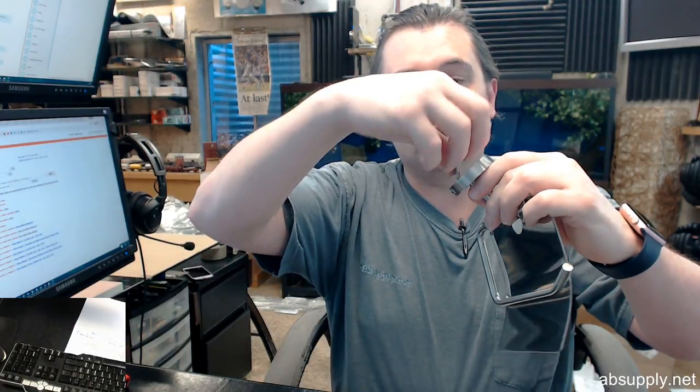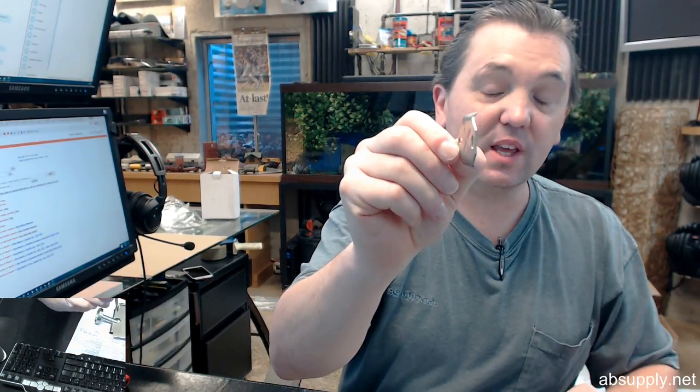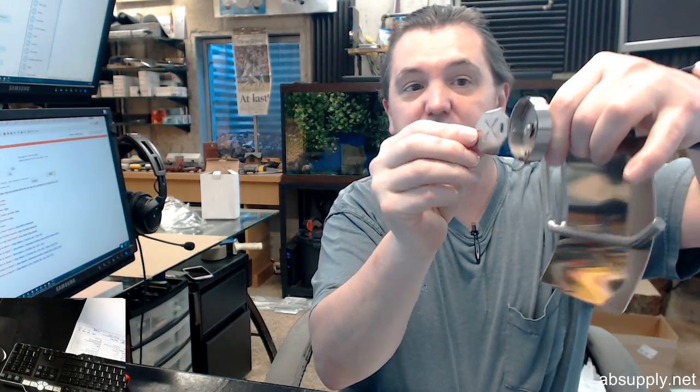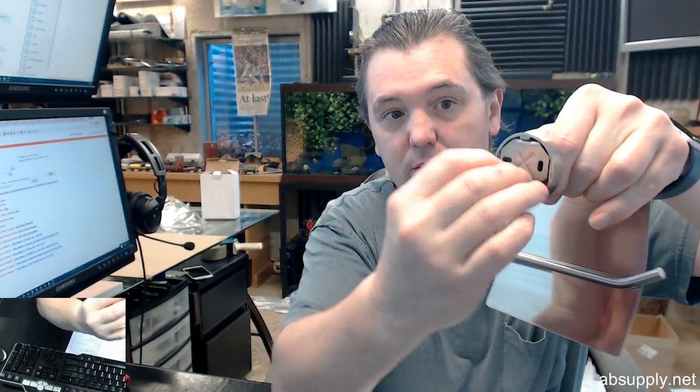There is a wall plate that's held through the set screw that you may have noticed down here, and I will quickly remove that. Once you get that set screw loosened, that wall plate will come out. You'll attach the wall plate to the wall with the flanges pointed towards the outside. A couple of screws are included with plastic anchors, and then the Allen wrench that you'll need to handle both aspects: reversing the bale should you need, and loosening the set screw that's down here. So the plate goes on the wall. This will seat right over the plate. It will look like that when it's done. And of course you're going to tighten that set screw that's there.